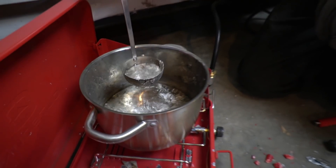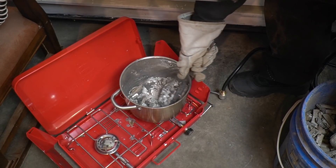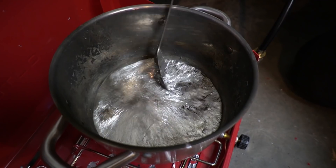This is actually the first time I've ever done this with lead, so huge thanks to my friend who gave me not only a ton of tips but loaned me most of the equipment. One of the most surprising things was how long it ended up taking. It's actually the next day now, because I went all night at it until I was finished. When I do it again, I'll probably use a bigger pot, but the biggest thing that would change the time would be not doing it in cold weather. The wind really picked up last night, with a cold wind blowing in from the crack in the door and the fan blowing cold air across it, which kept bringing the temperature down. I probably would have gotten through that bucket twice as fast if not for that.